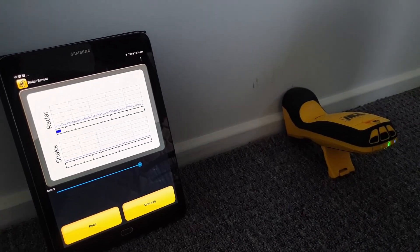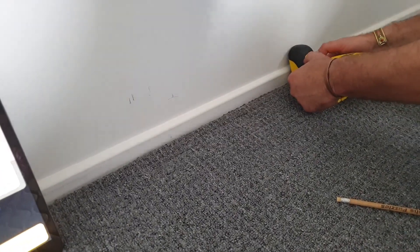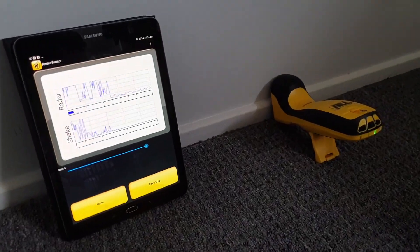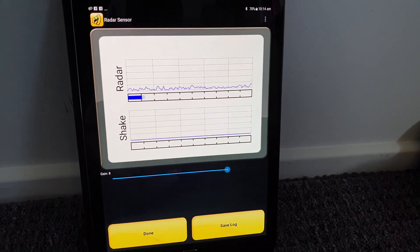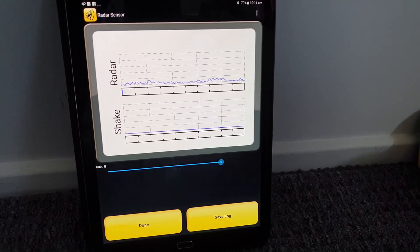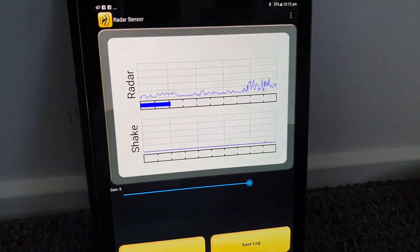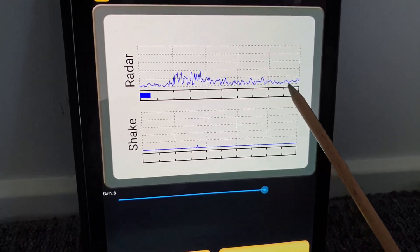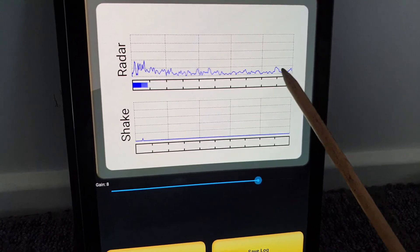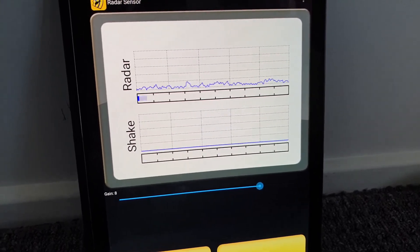That's indicating I'm on the 45. I'll just move it along random areas on the same plane. I have gone about 12 inches or so here. Make sure we're all still. Again, we're getting a little bit of a pattern. I'll give them a bit of a tap. That was me, but now we can see those termites — or the movement — has certainly intensified that little bit. A very strong indicator of termites again travelling through there.